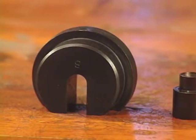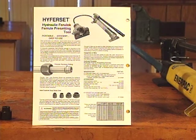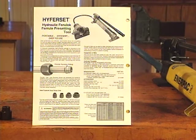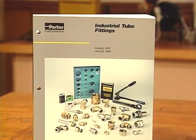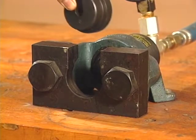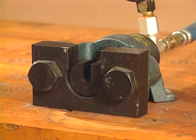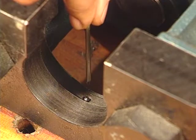Your first step is selecting the proper parts for the pre-set job, including the nut support and body die. Refer to the chart in Operation Bulletin 4393B1 to select the nut support that matches the tube outside diameter and the body die that matches the tube outside diameter and the fitting series. You'll also need to know the pre-setting pressure appropriate for the tube size, material, and fitting series, which you'll find in Parker Tube Fittings Catalog 4300. Once you've chosen the correct parts and pressure, insert the nut support in the backup plate opening from the inside so the shoulder seats squarely in the counterbore. The spring-loaded ball plunger secures the nut support properly.